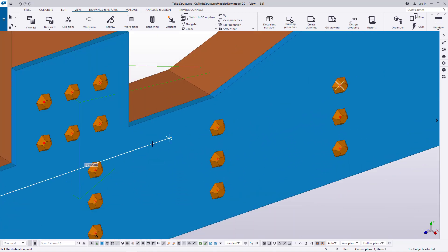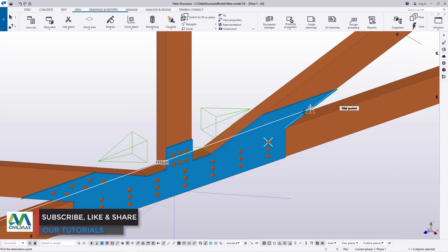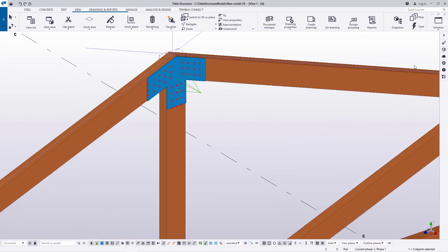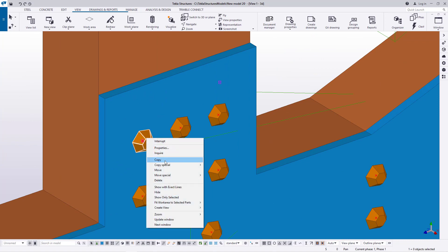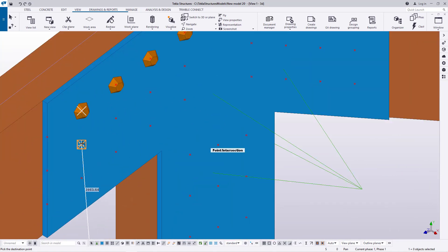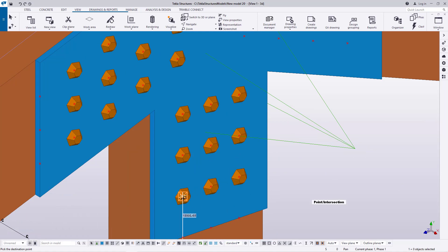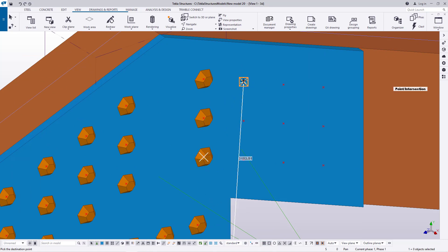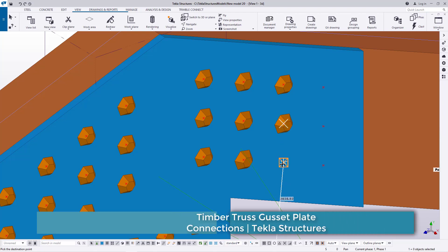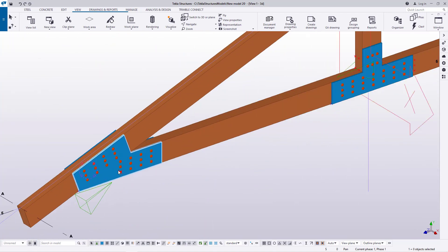Let me place these so you can see how they're arranged between the top and bottom chord for connections. This end I haven't placed yet, so the next thing I'm going to do is mirror this section — the nails or bolts will come at that end. I'll select one, right-click, snap into position, and distribute them across to the top end. I'll continue distributing all these bolts or nails to these connections.